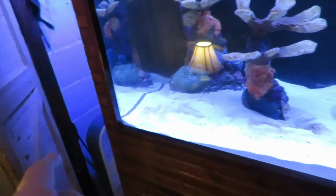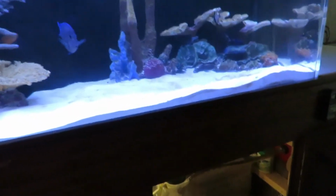And I actually put a vent on that end over there, so that air is being pulled from one end across, and it keeps air moving at all times. Another thing that I have done is I tied into my central air conditioning duct work, which is right here. It was already existing going across the top, and I cut a small hole in it. In the summer, I put a tube in here, and it blows cold air down on top of this system. Air conditioned cold air blows on top of it, and then that fan down there blows that air across. So that way I don't have to spend a lot of money on getting a system to keep this thing from overheating. So that pretty much covers the filtration part of this thing.